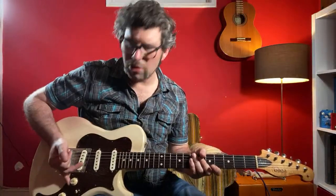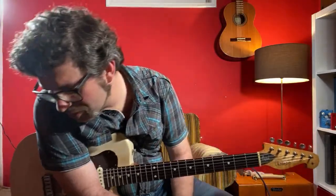No, it's nothing like a treble bleed. So the treble bleed, whenever you move a normal pot down, it cuts treble more than the rest of the sound. So a treble bleed regains that, so it lets more treble pass through. That's what it does. A treble booster boosts the treble and cuts the bass. So it's a different thing, and it is a booster, not a cutter. I hope I explained myself.